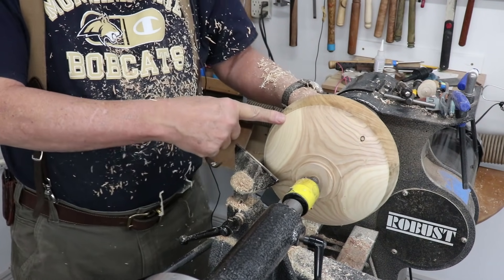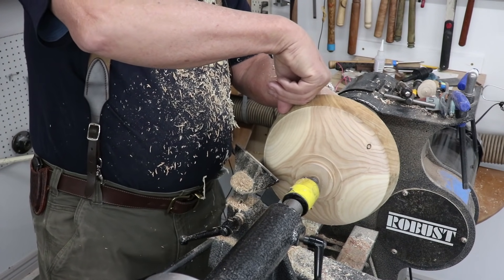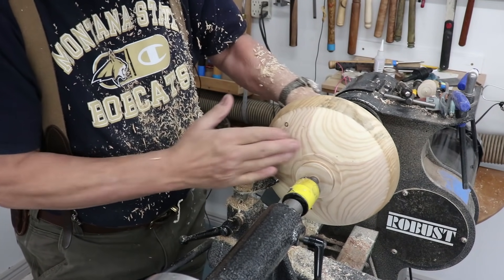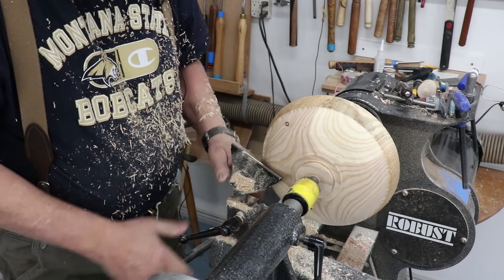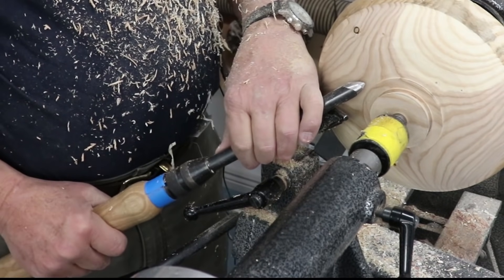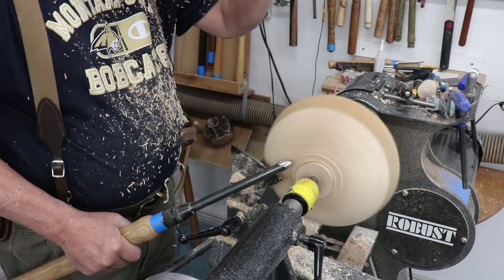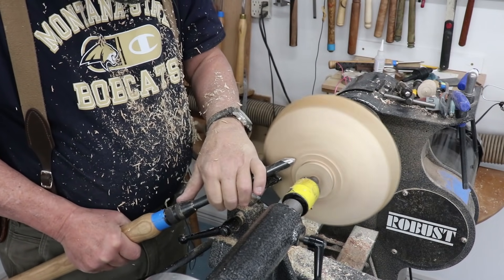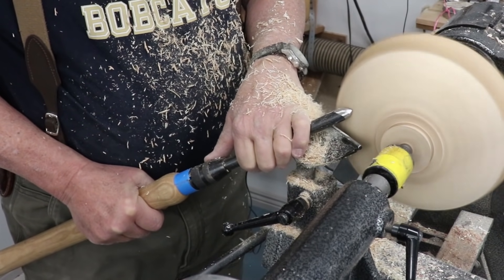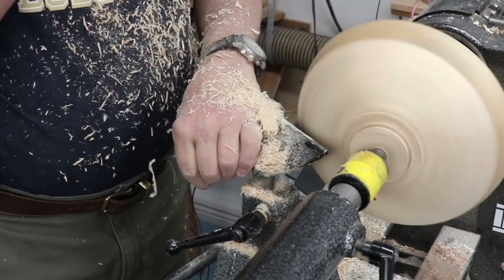I can do a push cut right here. I've got a little detail on this rim area that I want to save — I'm still a good inch thick, plenty of room. The other thing I can do while I'm here is practice a shear scrape: take my bowl gouge and really lower the handle so the cutting edge is in a shearing orientation. I'm going to turn the lathe speed up just a little bit — and those are the shavings that you want: little spiral shavings.